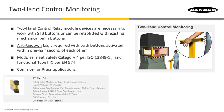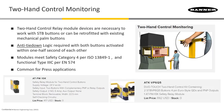What's common for a lot of these applications, if you're just looking for a simple module, is our AT-FM-10K — that is the module that's looking for those two STB buttons that are coming into it. And by the way, it doesn't have to be our STB buttons necessarily, as long as you can accommodate that complementary input — an on and an off state coming from a solid state, or the normally open, normally closed coming from mechanical buttons. But there is another model number that gives you a kit, and this kit's going to give you the two buttons along with the anti-tie-down module.